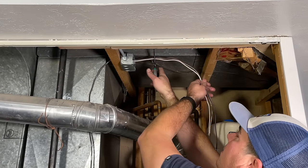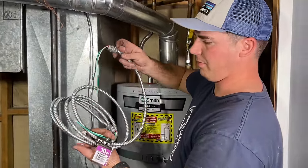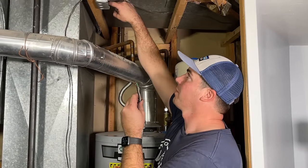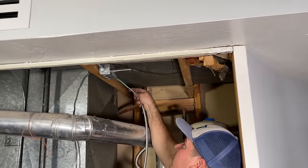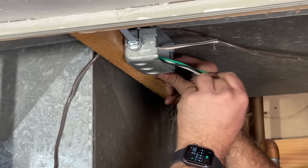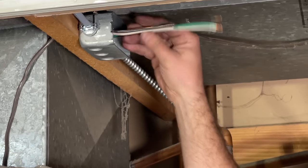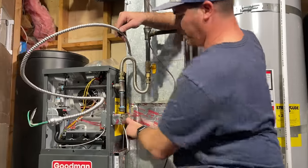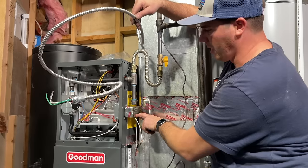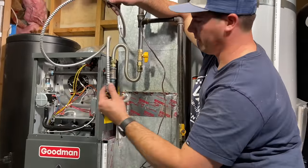Don't get these too tight — just snug to where they're not moving. We can go ahead and clip these to the proper length, giving ourselves a few inches here. We've got our 12-2 metal clad cable — this is a 10-foot section; I think you can get them in 6-foot as well, and they're very easy to use. We just have our knockout on the other side of the box — feed this through, and it just pops into place. It locks in, it's not moving, it's shielded from any sharp edges, and then we can simply make our connections there. We need to cut this to length — I wanted to show you how to cut this metal clad.